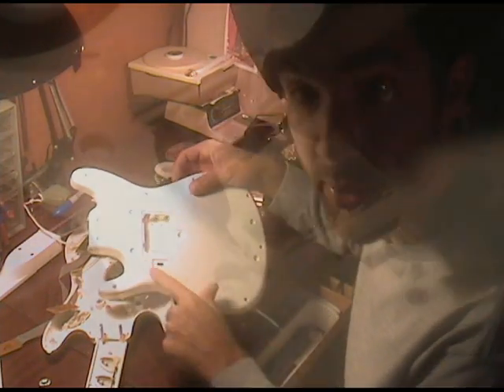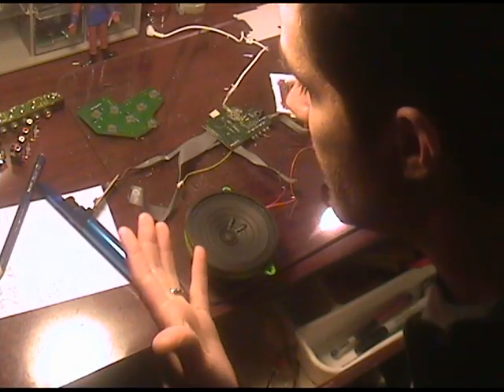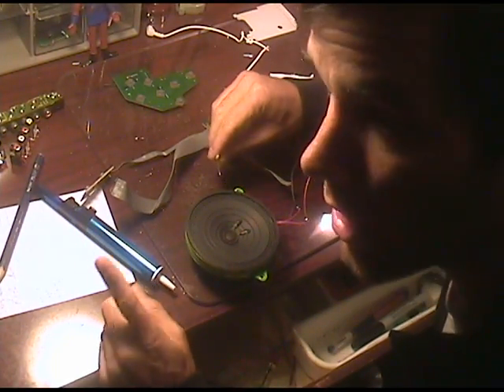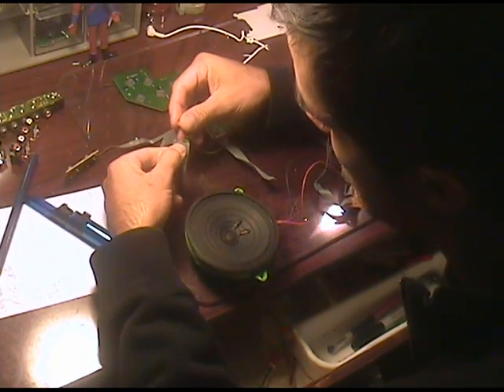My soldering iron is heating up so I can detach the ribbon cable to the string interface. I'm going to break out the Dremel and pack out the battery compartment so I can use it again. Removing the ribbon cable there. Now I've got all of the button boards removed and I'm left with all these ribbon cables. Here's that wire that goes to ground that was originally going to the string section, and I can just rub it across the ribbon cable here and complete these little circuits.